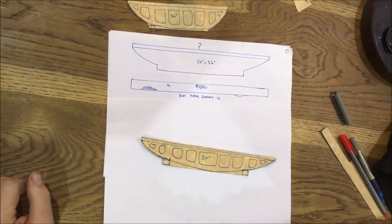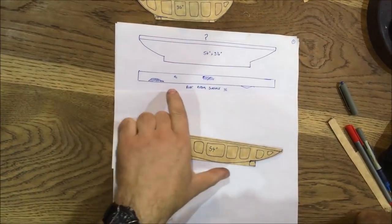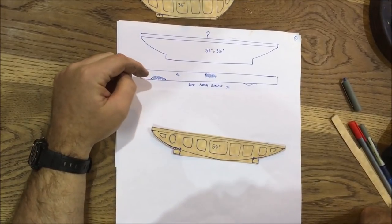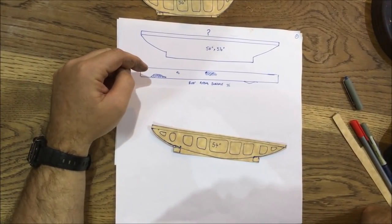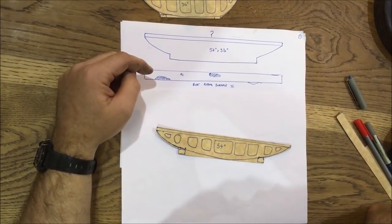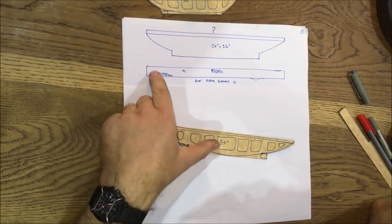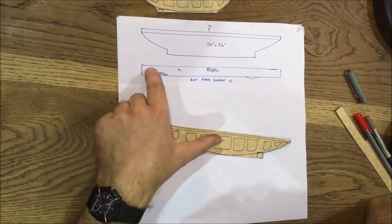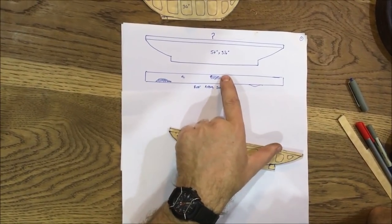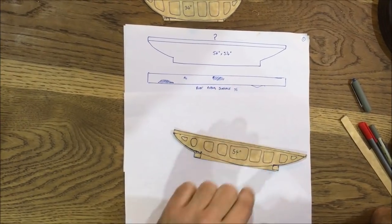Upon shifting all the rust from the surface of the straight edge, there was some serious pitting left in the areas marked, and that pitting was something in the region of 80 thou deep at its worst, of the bits I could actually physically get a measure down. There was, in this area, no evidence of scraping left, and none in that area. This section, which is about just under half of it, was pretty good.